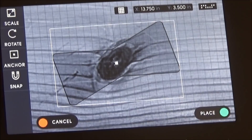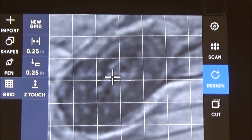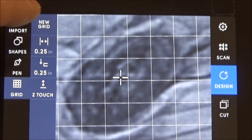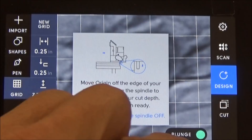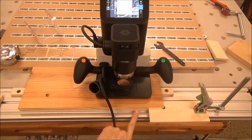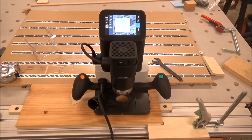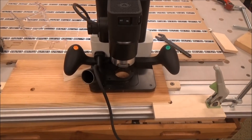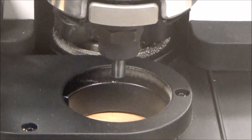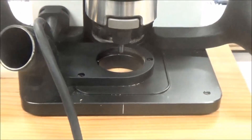So let me show you how you program the grid in. I'll set up a new grid using this same board and show you how you do that. I canceled the placement of that artwork - it zoomed in for me. Now I'm going to go up here to new grid, and it's going to tell me to pull it out to the edge of my workpiece to take a couple measurements. What I've got in there is my V-bit upside down, so it's basically a straight bit - you can see it. This is what's going to register against my workpiece.